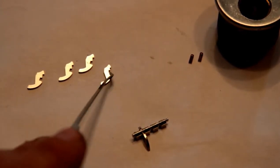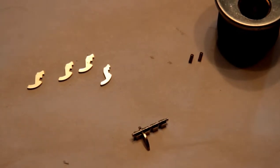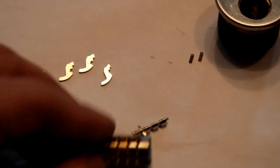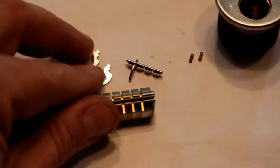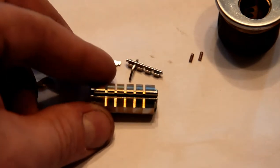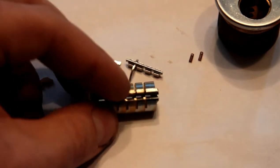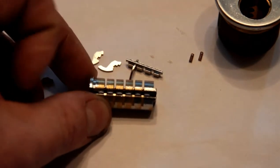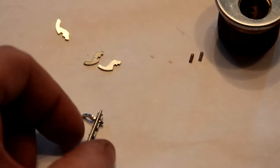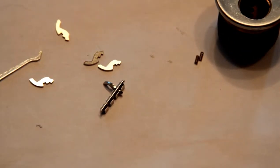That's a number one cut — you can see that the little slot is in the middle. These little guys ride inside the grooves. They kind of rock around in there because obviously they can't pop out when it's in the core, and those little slots move back and forth with respect to the sidebar. When they all engage, there's a little shot of one engaged. I would have one of these assembled for you but they have a nasty habit of falling apart, and I've not gotten one on camera yet that didn't.